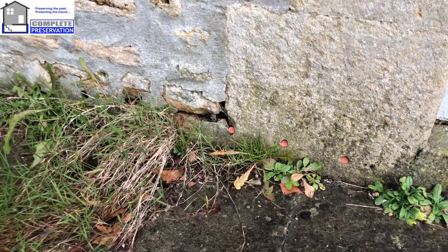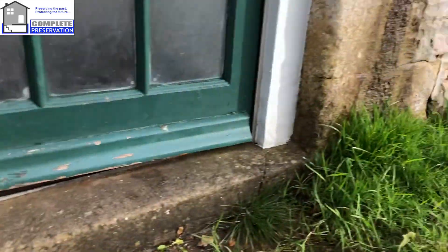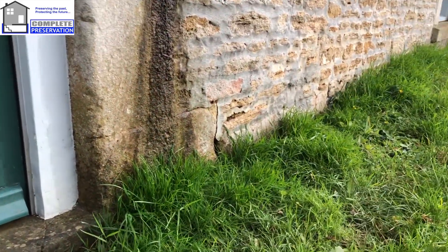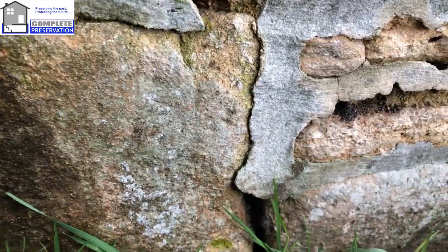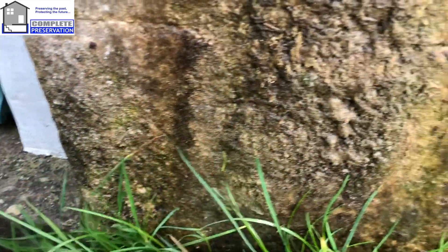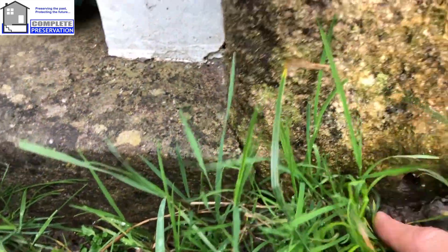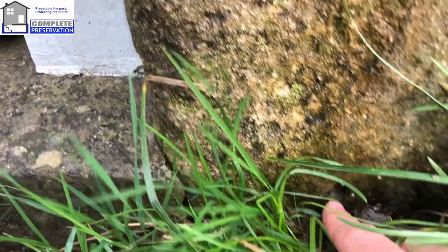Hard sand cement pointing, so it's not going to allow any evaporation on there. And somebody's had a go. This is just adjacent, this area, so it's not exactly that area, but you can see what I'm seeing here - big voids in the wall. This has had some sort of damp proof treatment, as you can see from some holes - maybe some form of injection damp proofing, I'm not exactly sure. You can actually see there's a smaller hole down there as well. So that's probably been done at a similar time.